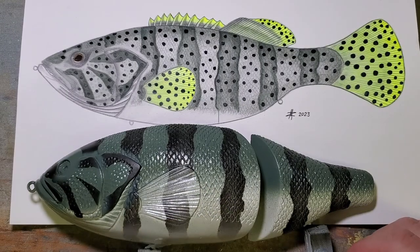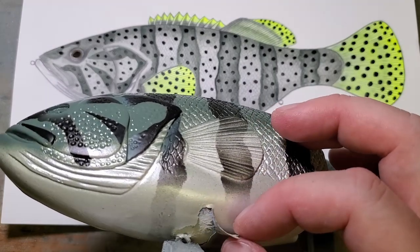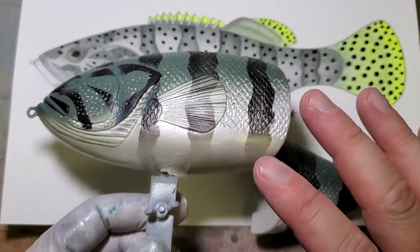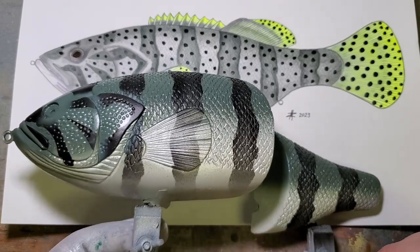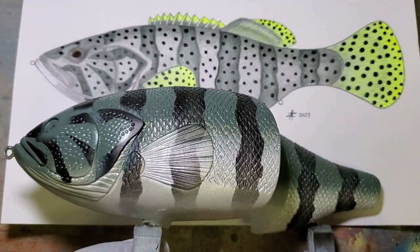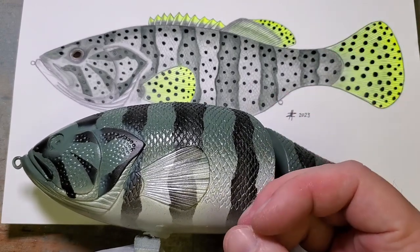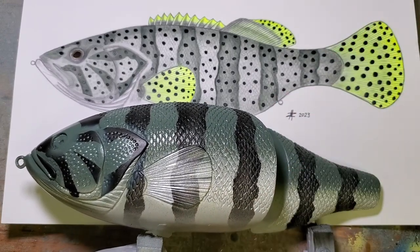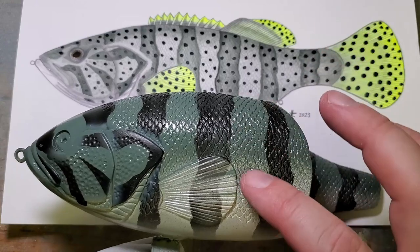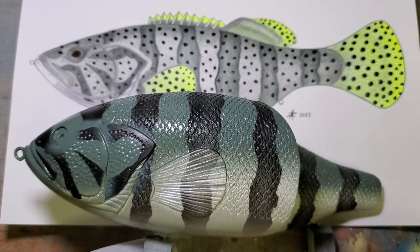The other thing we can talk about here is this peeling that I've got in the bottom. I think that's a moisture-related issue because I used drywall spackle to smooth some of that. It may have still had a little bit of moisture in it, which caused it to delaminate when I peeled it with the tape. I don't ordinarily have problems with that, but either it wasn't dried out very good or it reabsorbed some of the moisture from the paint. In any case, that may not be the best material for larger areas. It didn't give me any trouble on those micro bubbles that we fixed, but these larger areas, that may not be the best thing to use.